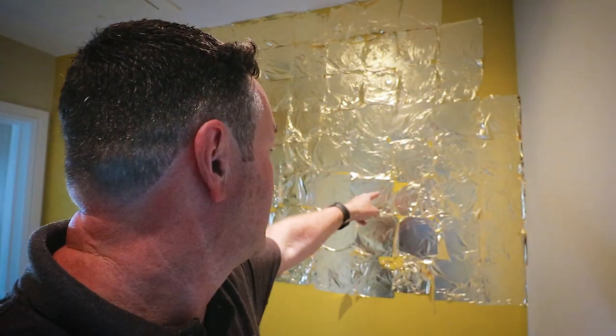Right, that's actually my first 100 sheets gone. Now, I'd measured up and I predicted about 206 sheets needed for all that wall. I knew by the time you do your overlaps, you're not going to get butt joints, so you're not going to get it exact. The way it works is it can overlap on itself and, like you say, there's probably holes in it. So that's why I'd ordered 400.